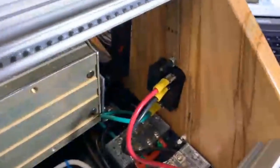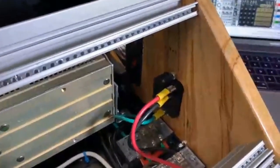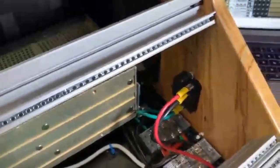Ultimately, you do want to connect the ground on your DC side back to the ground on your AC side. They're all supposed to be tied together. And most power systems I have found leave it floating, and that alone causes extra noise and hum. If I just grounded the rails in the system with the old power supply to where my mixer was, the noise level went down. That was one big change.